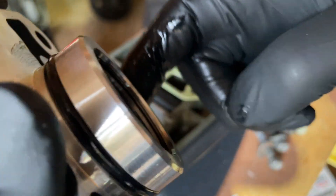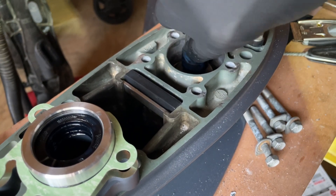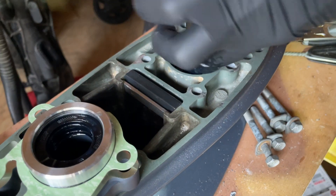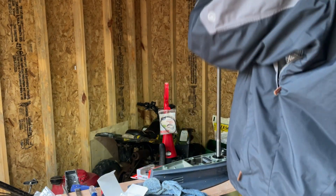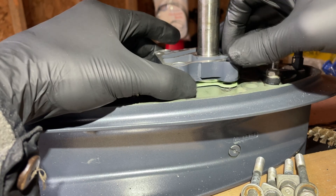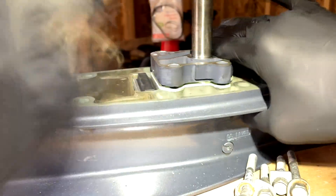Now that we have that lubed up, we'll go ahead and slide it on. Get this shaft nice and lubricated. I'm going to lube this up too, just to make it easy for those oil seals to slip over. I'll also put oil on the outside just to help it all slide in. I'm going to slide this gasket over the O-ring and then slide this thing down the shaft. Be careful not to force it and pop one of those springs out of the oil seal — just try and turn it back and forth, slowly working its way down.